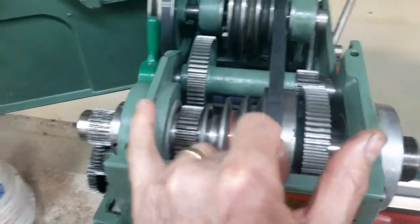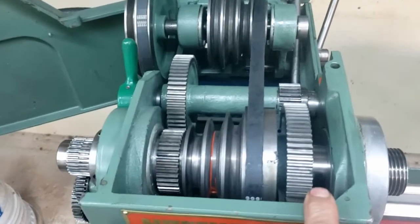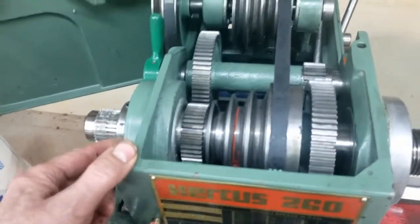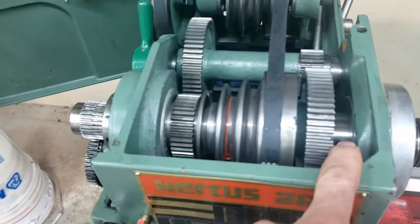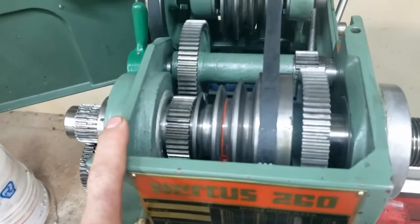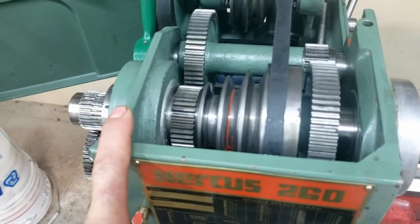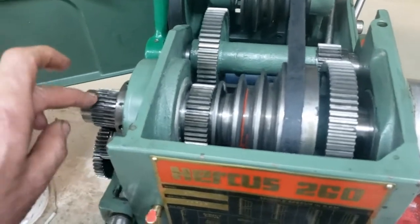They have an existing width, and they take up room between the two cones of the bearing. So even though you want to tension here, it actually tensions the cone of the bearing up against all of these infill on the spindle. And so it doesn't allow you to actually tension the bearings of the spindle. So I think that's because of the wear on the tapered bearings. So I did order some tapered bearings and a spindle as well for a different reason, just because of this gear.